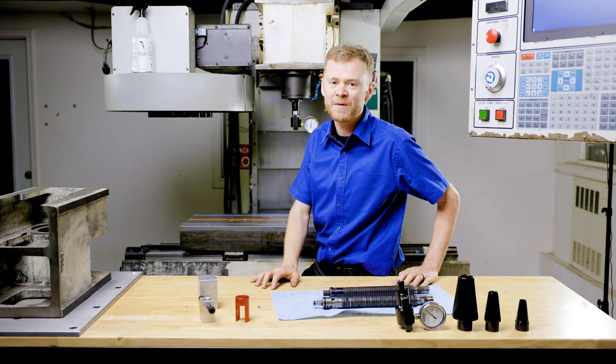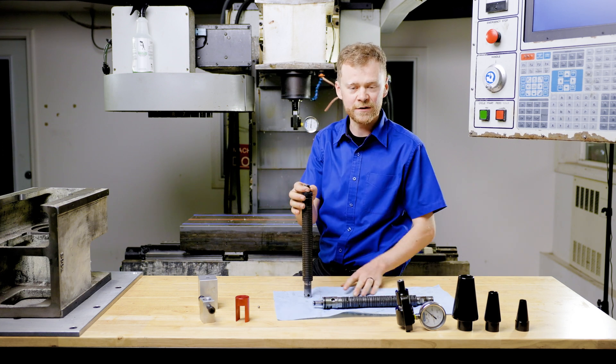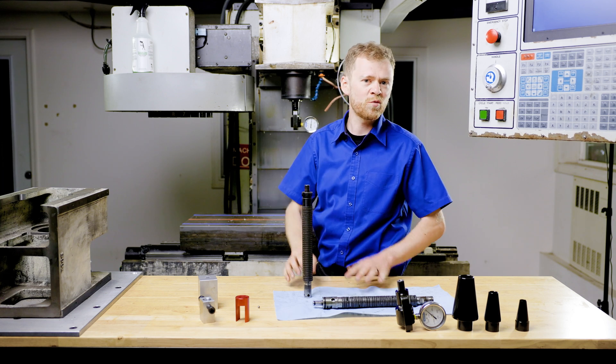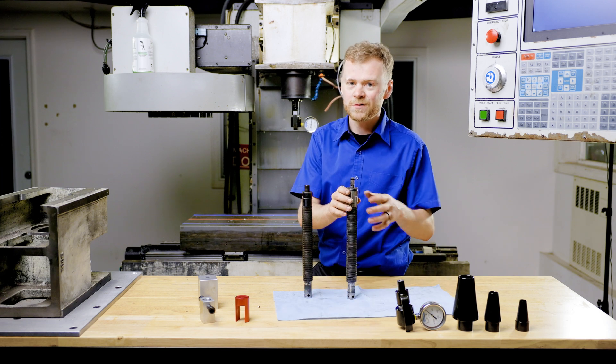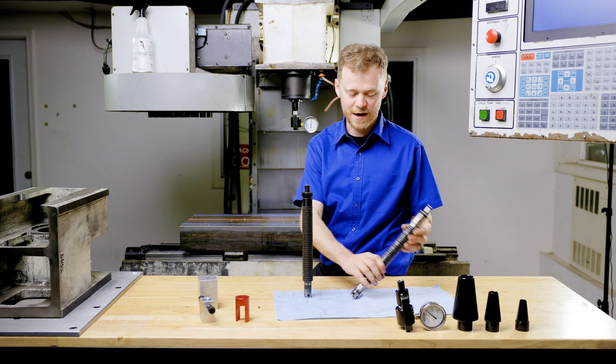Now I don't know if the drawbar has been replaced. Let's talk about what you should read. If you have a belt drive machine, your drawbar should be between a thousand and 1500 — some of them were 1800. If you have a super speed machine, this is a super speed drawbar, it should be above 2000. Now when it gets below a thousand, you're going to start to have tool changer issues — I've seen a bunch of that.